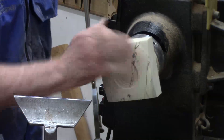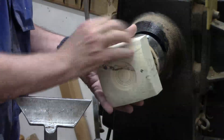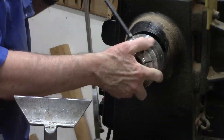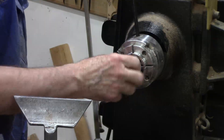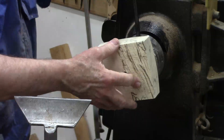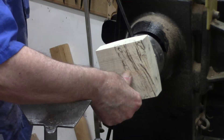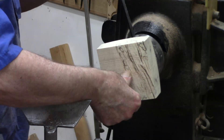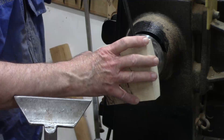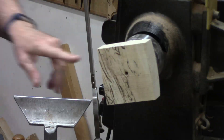I'll just unscrew this. If you want to learn more about the woodworm screw, I've got a link above. Take out the woodworm screw, close the chuck up, slide it in there, press in the middle, and slowly open it up. Don't turn as hard as you can — we don't want to blow it out, we just want it nice and snug. Now we're going to deal with the inside.